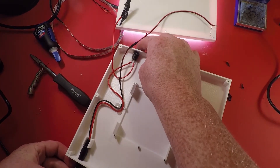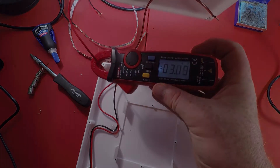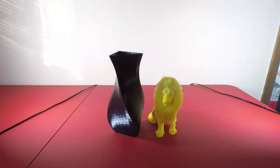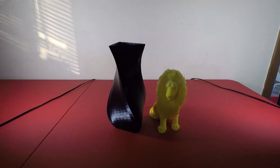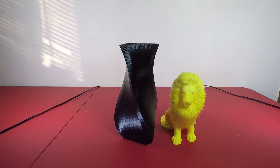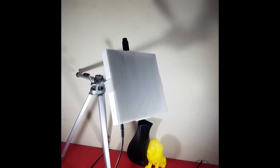Now I am going to plug in 12 volts and test. Let's see how many amps this takes - it only takes 3 amps. Last, I am going to put in all 8 screws and our LED light is completed. As you can see it can be mounted. Testing without the diffuser first, then with the diffuser - as you can see there is less of a shine with the diffuser on, so I think the diffuser works a lot better. This concludes my video, I hope you found it helpful. All the parts and where you can get your own CR-10 are in the description below. If you would like to see more videos like this please subscribe, and thank you for watching.